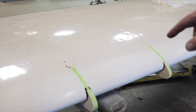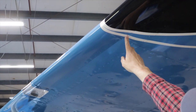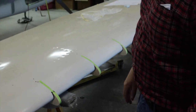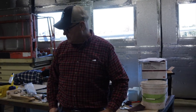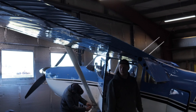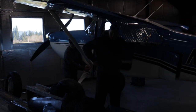The way this STOL kit works is it's a non-structural addition. This is what gets riveted to the front — there's this new piece of airfoil, and the foam blocks provide the strength to it. So it's actually a non-structural rivet you can use. It increases the wing area — I think it's four inches of chord and four feet of span area.